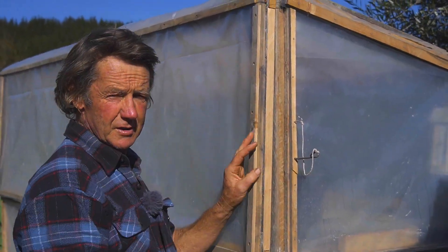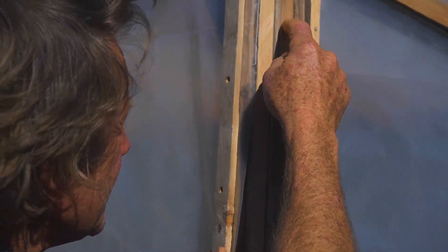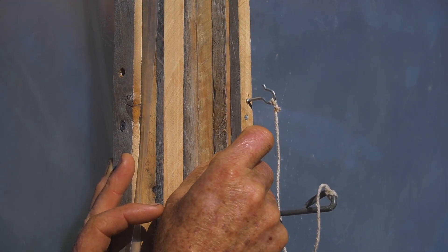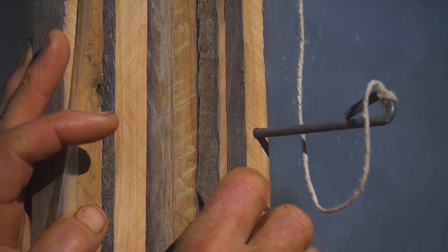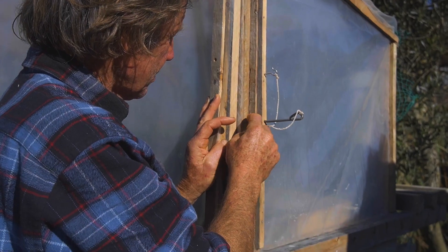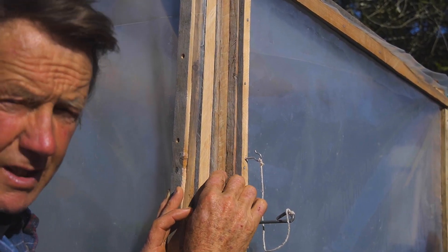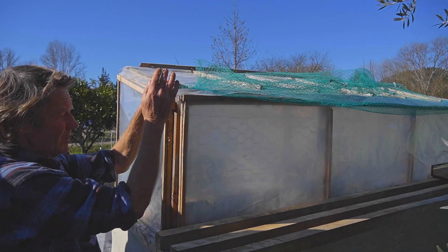The plastic on the front we fit onto the frame in the workshop. The plastic on the sides we fit in situ. Here's the main frame - this is a 50 by 50 millimetre. We tack the plastic onto this frame and then tack a 20 millimetre strip to hold that plastic onto the frame. Then we put another layer of plastic, which gives us our 20 millimetre gap for good insulation. Lastly we put a thin strip of wood - it can be 20 millimetre too, but in this case it's about 10 millimetre. So we've got two strips of wood tacked onto the frame, each one holding a plastic sheet. We repeat that technique on the back and on the roof - same thing, all done in situ.